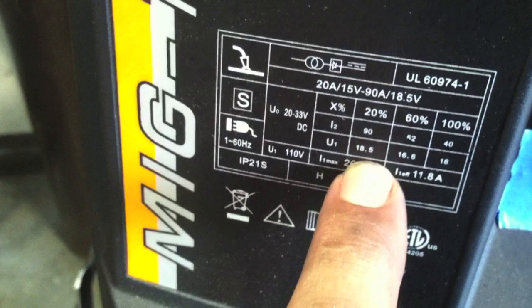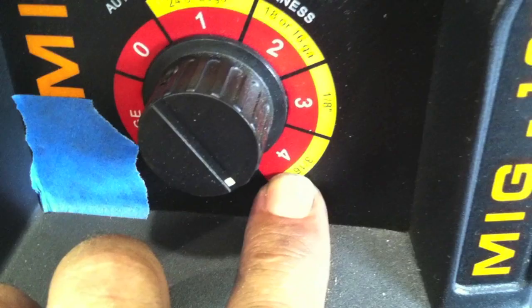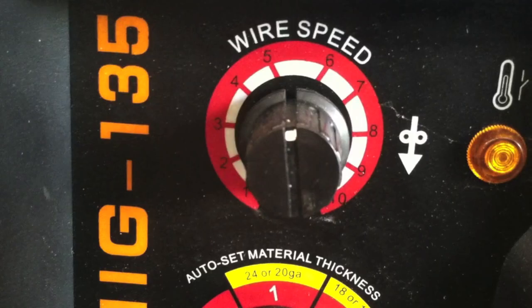It's rated at 20% when it's close to maxed out. I would say this one is a lot closer to 10% — it only welded about six inches before the overtemp came on with bare wire and 75/25 gas. You get more out of it usually using flux core: more penetration, more thickness rating. So that's what we're doing today.